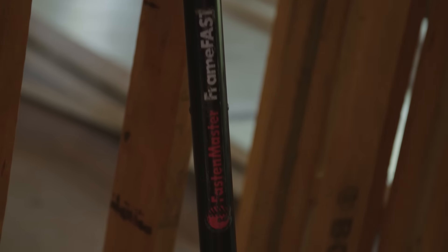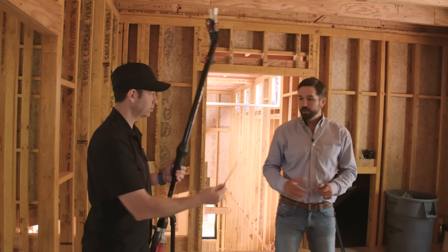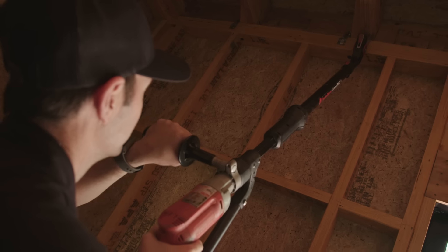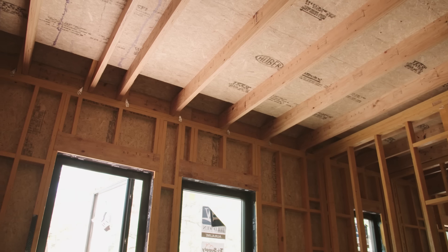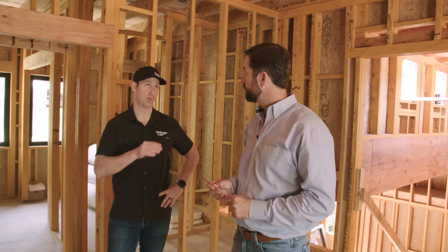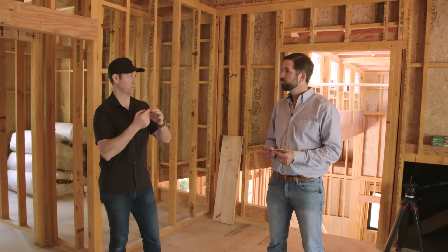The guys at Fasten Master lent me their truss screw tool, which is fairly new to the marketplace. It's at a preset angle so you can come in and install the truss screw right up into the top plate. These have a very small head - a discreet connector - since some people don't like exposed metal connectors. One thing I did find though: with LVL engineered lumber, it was a little harder to get the screw started than with traditional SPF framing. That's why the SPAX power lags were nice - they just sunk right in with no pre-drilling.